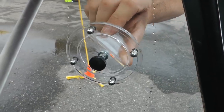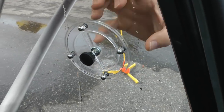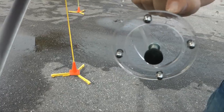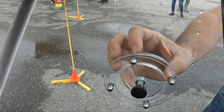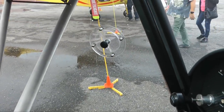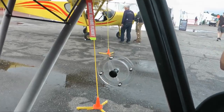I've changed from the standard Zenith vents to the Vista vent, which you can order from Aircraft Spruce. It comes with everything except the backing plate — I've seen folks do that with aluminum, but I opted to order a piece of Lexan and cut it in a circle. The bolts fit inside the Zenith standard cutout, so it's just sandwiched in between with no extra holes. If you have any cracking issues, you can sandwich everything together without any extra pressure on the glass.